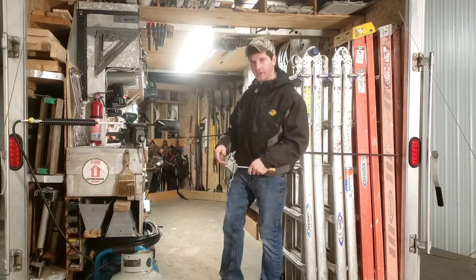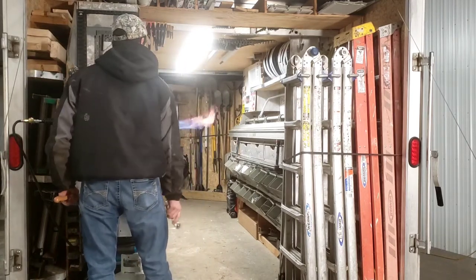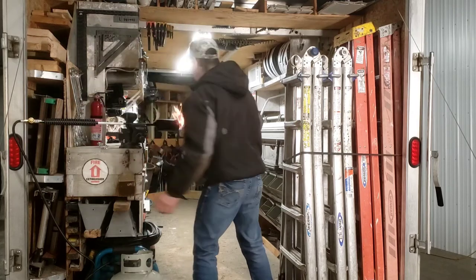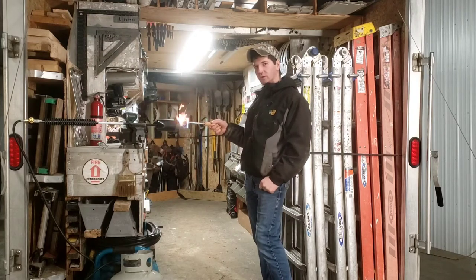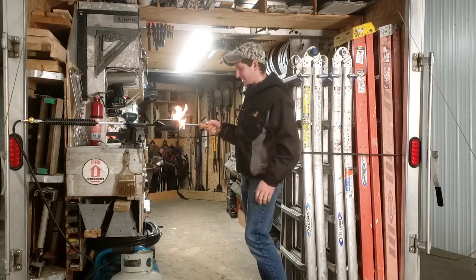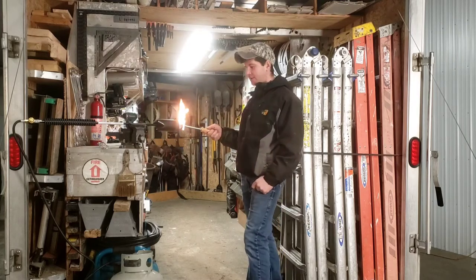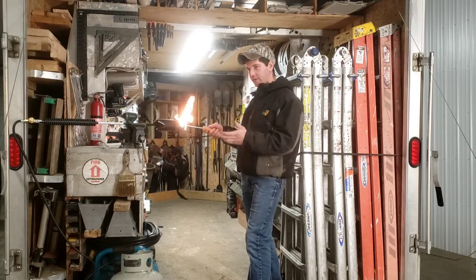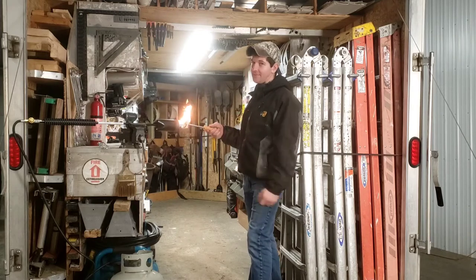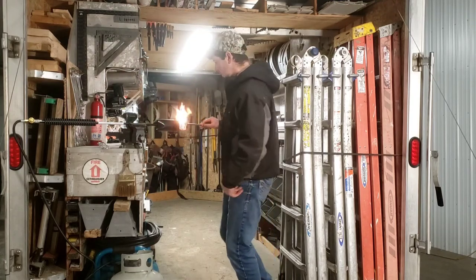Anyway, this is the route we went. I've got my torch here — big propane torch — just clamped in the vise to hold it. I'm going to fire it up, heat this thing up, and show you guys what it's got. You don't have to have a big torch to do this; a little Bernz-O-Matic torch will work, or even a stovetop for that matter. This is just quicker and faster, and who doesn't love playing with a big torch? Just don't burn your shop or your trailer up doing it. It does take a little bit of time to get it heated. Once you've got it heated and preheated the first time, you can go ahead and stamp a tool, put it back in the flame, stamp another one — pretty quick process.